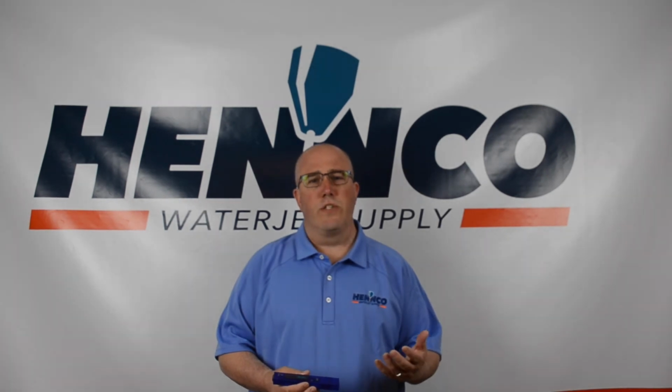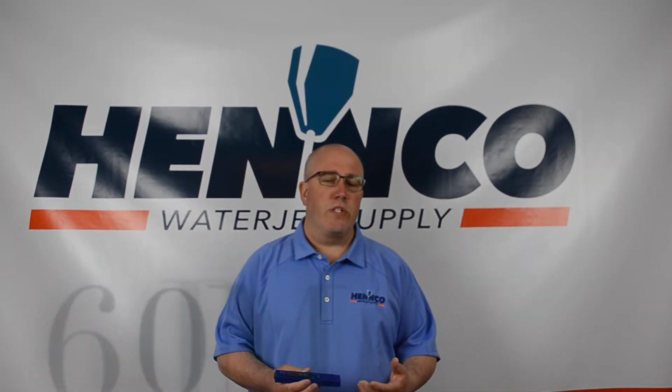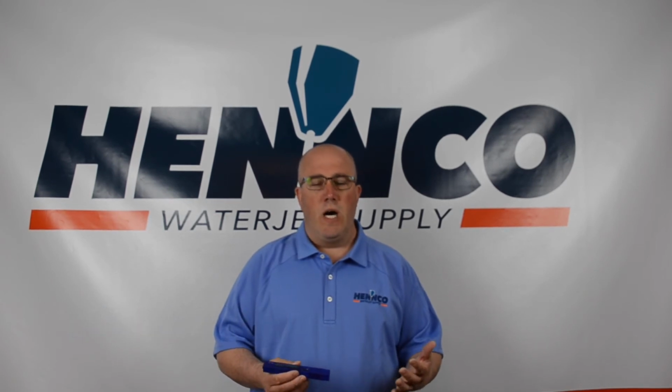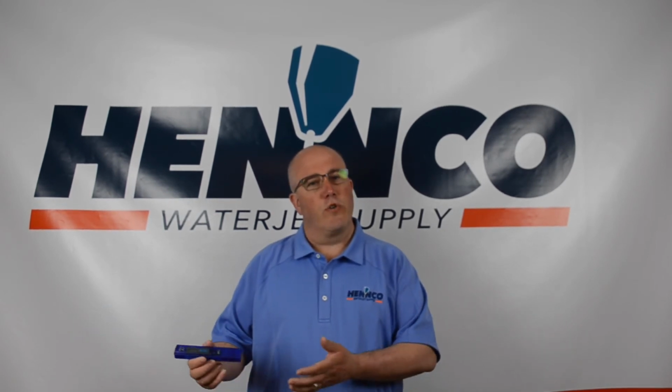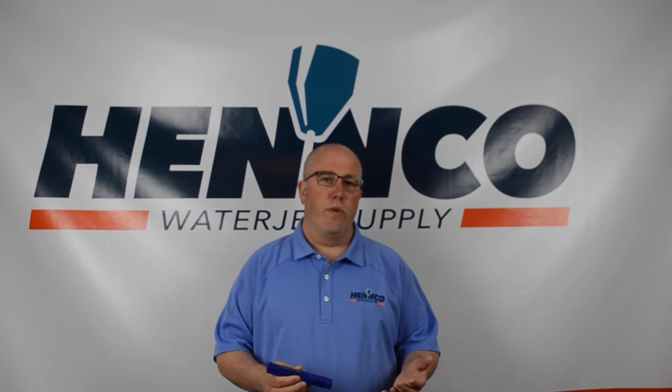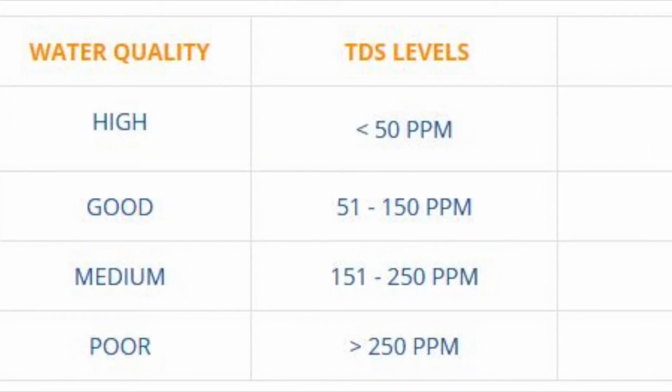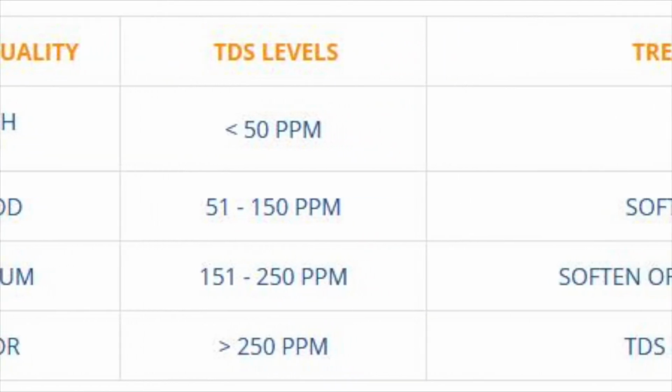We really like to see that TDS level between 60 and 80 parts per million. Reason being, it's kind of a sweet spot. It extends the life of whatever water treatment you have in place, as well as the filters, and provides good water to your system. All right, here is a guide that basically shows the different TDS levels